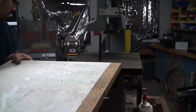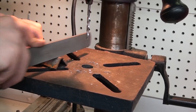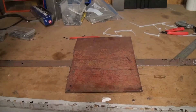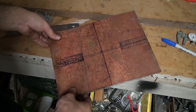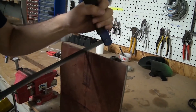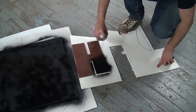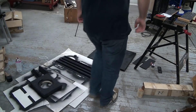Now I need some legs and a base plate. For the base plate I just used a piece of sturdy plywood, and for the legs I cut more steel L-channel and drilled holes for screws to attach to the base plate and bearing track. Before I can mount everything, I'm going to need a weight that will hang at the bottom of the vertical supports to prevent things from being top-heavy. I found a piece of steel plate, and after finding its balance point and carefully marking out the dimensions, I started cutting it with a hacksaw. After quickly realizing that was stupid and exhausting, I switched to the bandsaw which had a much easier time of it. Since I was trying to make this build look as good as possible, I took some time to give everything a nice paint job with some black spray paint. This is entirely optional, but I think it makes things look a lot nicer and should help prevent the steel parts from rusting.